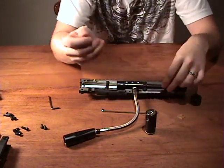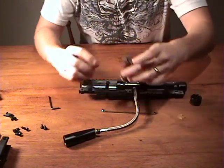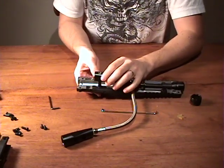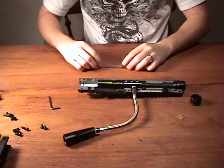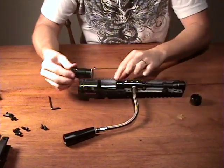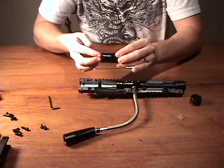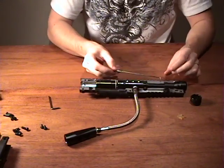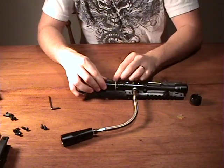Put in your expansion chamber plug with the grooves to the bottom so that it looks like a part of the main body. Then insert your back bolt so that all the holes on the cocking handle and back bolt line up. Make sure that the top hole is on the top of the main body, because you need to insert the retaining bar that attaches to the front bolt and the back bolt so that they move as one.